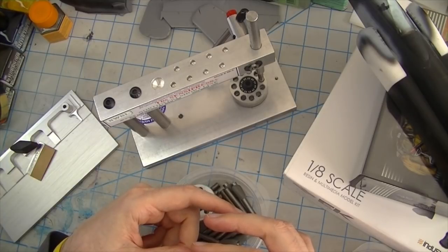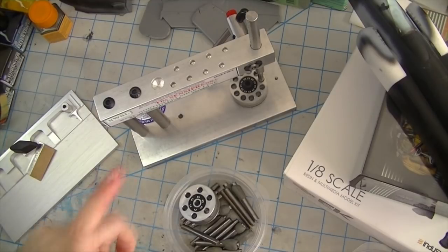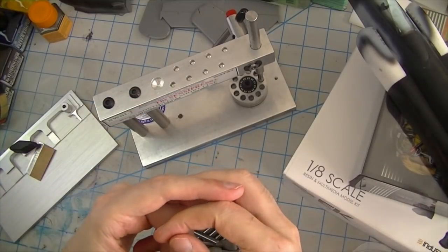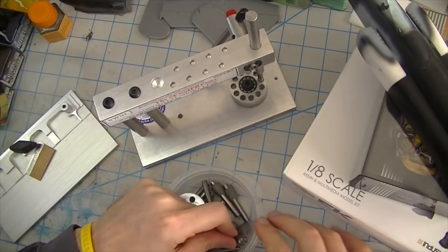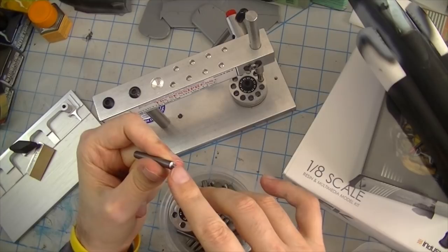On most of them, what you see is that the guide piece has holes the same diameter as the punch itself. So that means if you've got a 1 millimeter punch, you've got a 1 millimeter guide hole, and you've got then a very large diameter shank on top of that. And that's just an engineering fail, because where you go from the large diameter to the small diameter of the punch, like this, for example, except imagine the punch sticking out an inch. Well, that's a huge stress concentration right there.